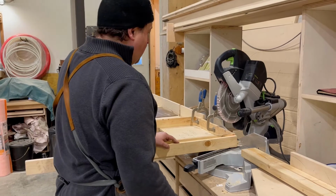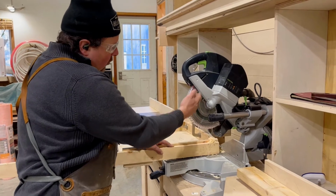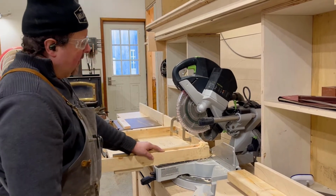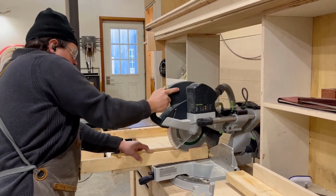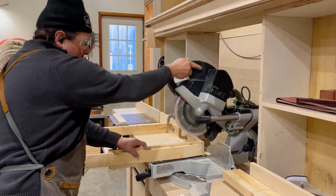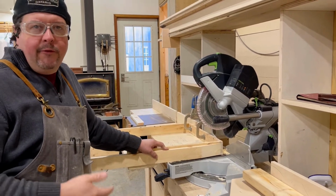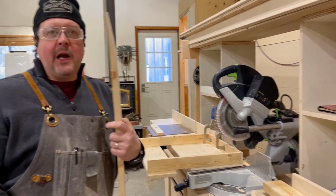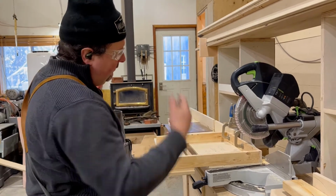So at any rate, once you're in place, you've figured out the scarf angle you wanna do. When you're cutting, you're really only limited by the distance from the hard bottom of the saw to the blade and how far you wanna cut out. Sometimes you have to go up and down a bit if the guard gets stuck, because it's not really designed for that. But you end up with a pretty shallow scarf cut, a very low degree angle cut with this jig.